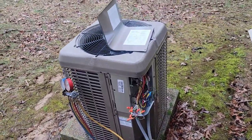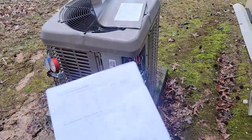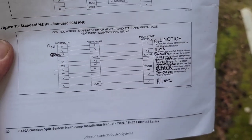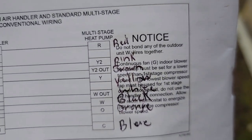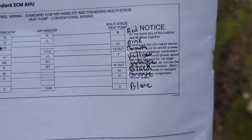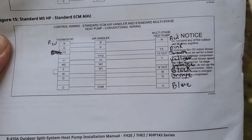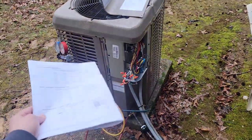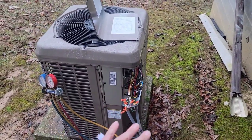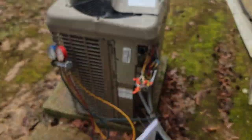This is not a dual fuel — it's just a split heat pump, so our auxiliary heat is electric heat strips. But a load calculation can help you fill out a balance point chart and figure out exactly when to program the thermostat to switch from the first source of heat to auxiliary heat. Back on site — equipment looks really nice, about to be started up. We're going to check CFM and BTU per hour. But first, I'm going to show you what I do to make sure low voltage wiring is correct: I write down the color of each thermostat wire for each terminal, starting at the outdoor unit, then go to the air handler, then the thermostat. This is the best way to wire it correctly.